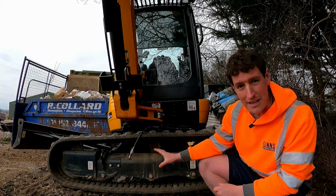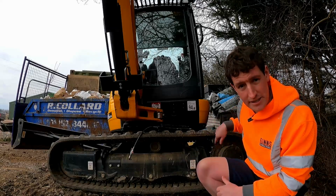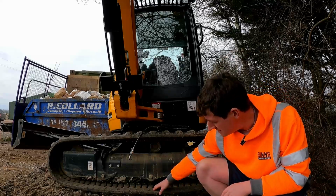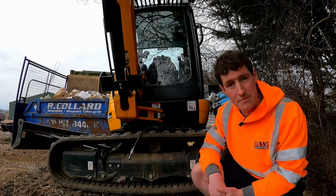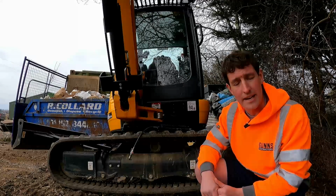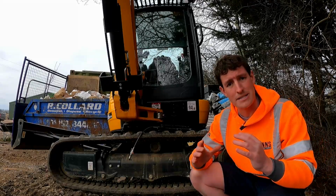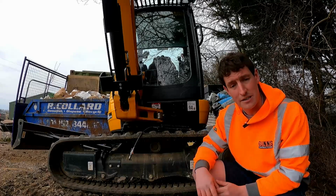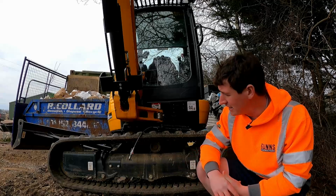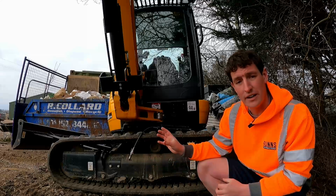If anything, for me, you'd want them a little bit looser, because you get a lot of stones and things, as I say, get caught in your idlers. If you tighten your tracks so that there's no gap here and this is all nice and tight, seems great now, but you get it in a bit of sand, shingle, or whatever these things tend to work in, and suddenly you'll actually be trying to tear your track apart, because it won't have that little bit of slack it needs to expand when gear gets stuck between the idler and the track. So careful of that.